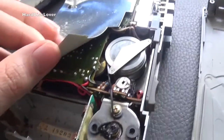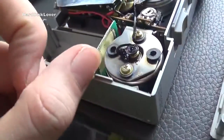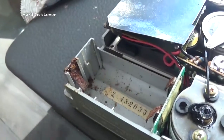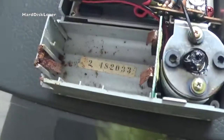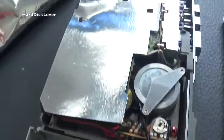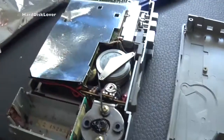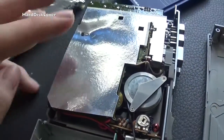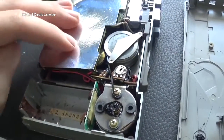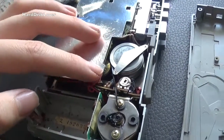I'm also going to have a look at everything inside here, just to make sure everything's fine. It doesn't seem like the acid has penetrated through the board, so it's possible to put some new contacts in or make some new ones. I'm going to go with the lithium-ion battery and clean all this stuff up. Just going to take this shielding paper off and have a look at more stuff in here. The last Walkman I had had some SMD capacitors that leaked and destroyed the entire board. This one I'm pretty sure won't have any SMD stuff in it since it's too old for that.